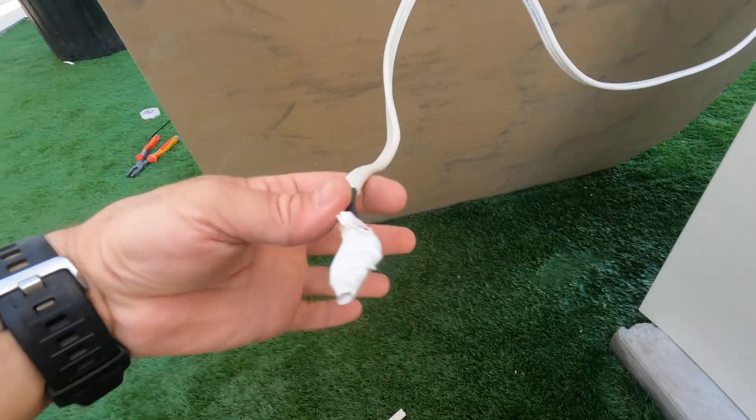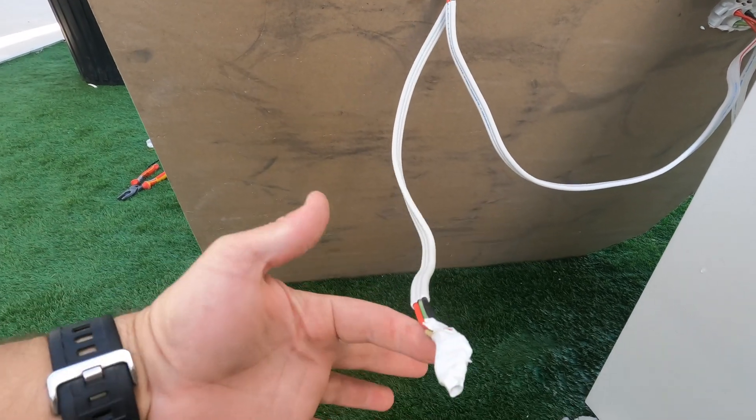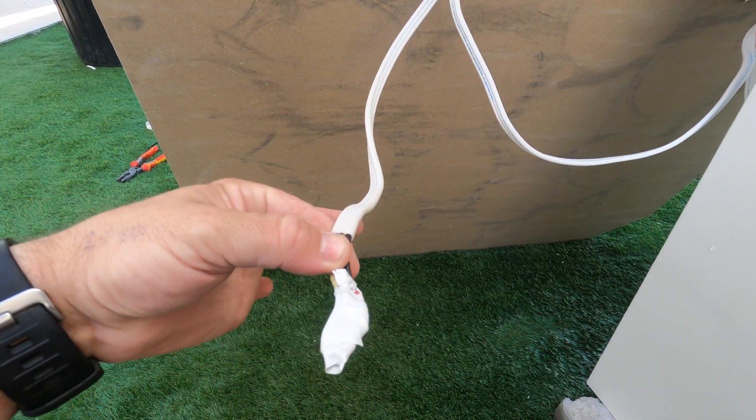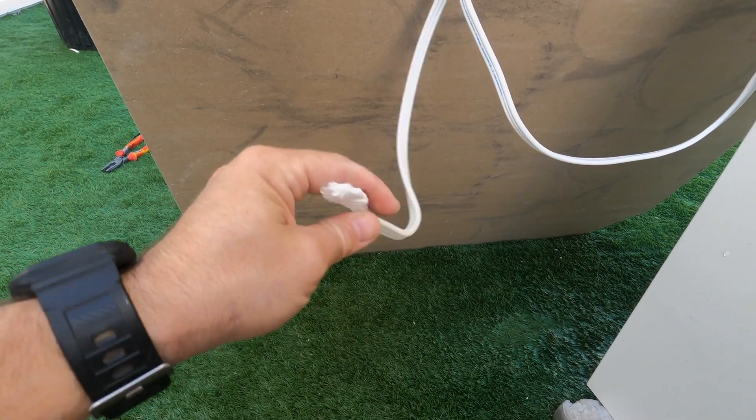This sort of fault could occur in many ways. Usually you won't have all three conductors coming up with a short — usually it's only two — but it does still happen. But if you pick that up on all three, then you can say it's most likely that you've missed a cable, it's been misplaced somehow. There are a whole pile of different scenarios — I've seen it myself — and you can go back and rectify it, so you will not have any live cabling out in the field. Nothing that can kill anyone, nothing that can cause any damage, and all you'd have to do is your normal testing to narrow down exactly where it is. It can be time consuming, but at least you will not have a live cable.